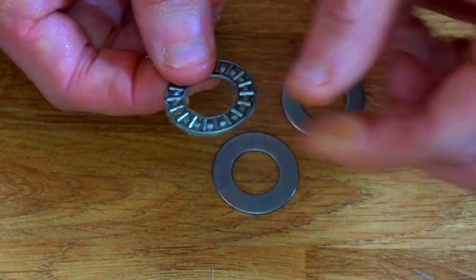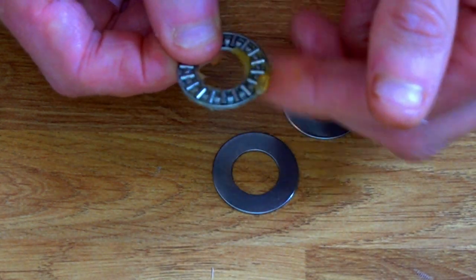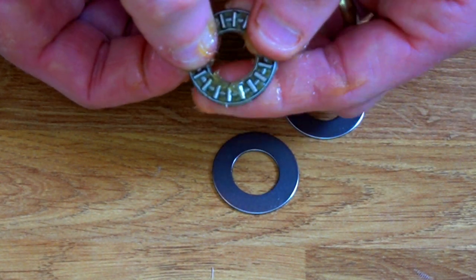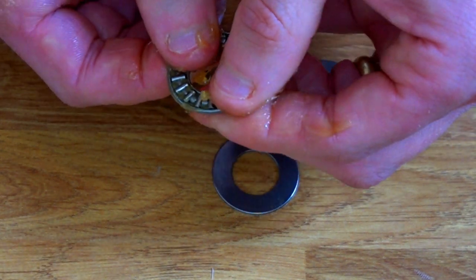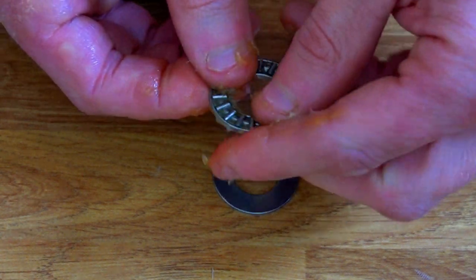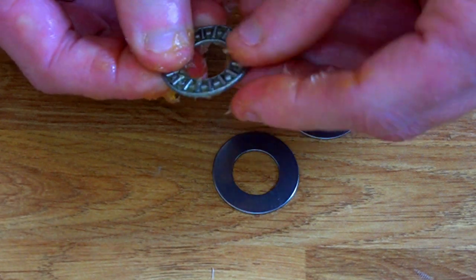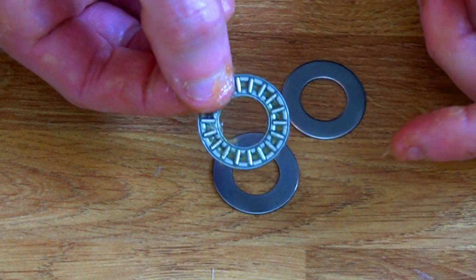Just pack it in to get through there. Just pack, work it way in there. All right, like so. Once they get through the needles, that's fine. Because what you're supposed to do is if you squeeze it out, you can see the beading coming out now. Just work it all the way in, like so. So you can see how dry that bearing was, very dry. So maybe when they assembled this together, they forgot to repack this assembly with grease. So it can happen. So that is the needle bearing